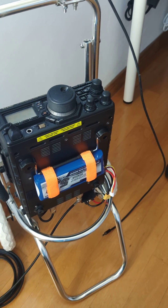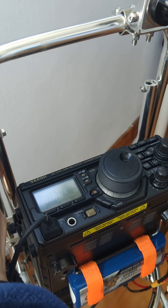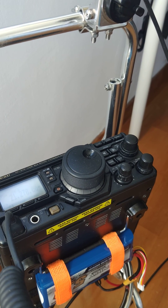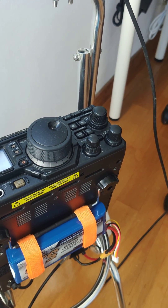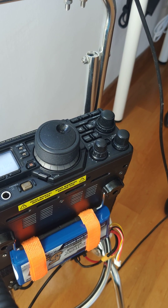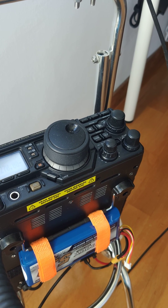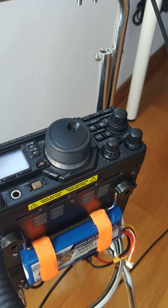The battery system uses LiPo batteries — very, very light. 5 amp hours, and LiPo is very, very small and very light. It's like a chocolate tablet — a very nice battery. I always use LiPo. 11.1 volts, because for 20 watts it's perfect for the Yaesu 897 that I'm using.